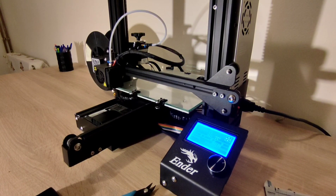Let me show you the method of bed leveling which I consider as the only proper method to do leveling. When you auto-home your machine, it thinks that the nozzle is at a height of zero. That means it should touch your bed.